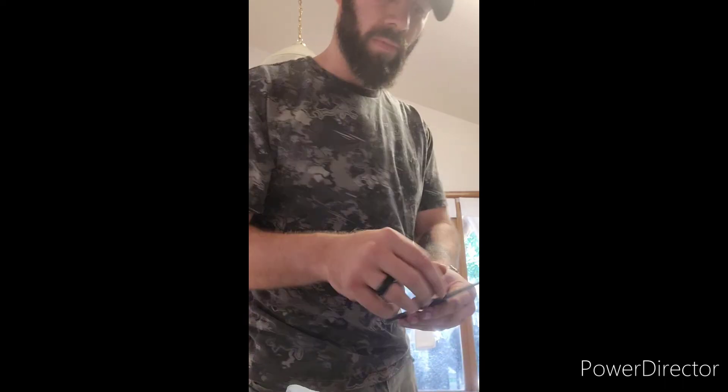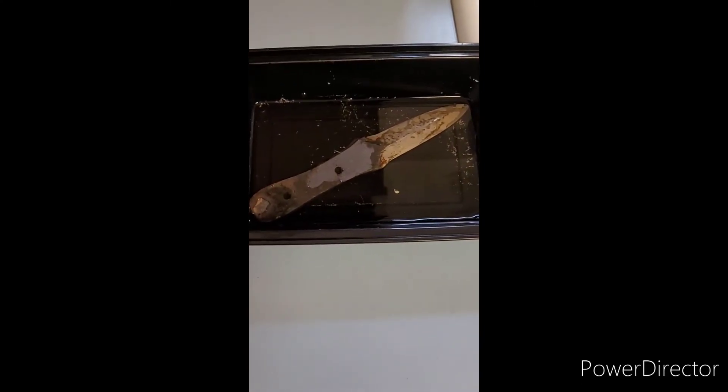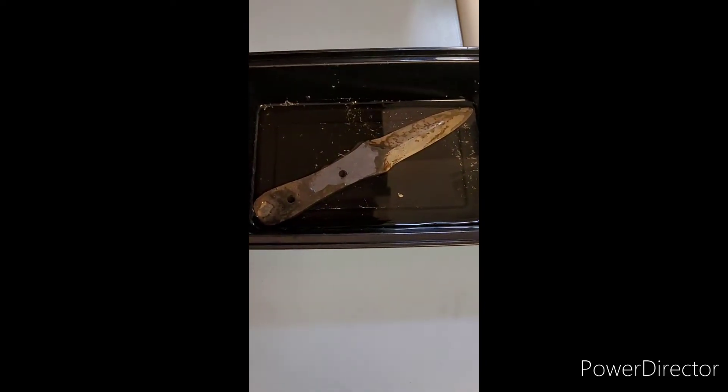Here's the easiest method. I used to do etching by heating up vinegar to put a patina on my blade. With vinegar it acts the same way — it'll eat that rust and create a patina. You're going to have to get used to patina knives with high carbon steel. The easiest thing to do is just dump the blade into a vat of apple cider vinegar. Leave it for eight to twelve hours, and there will be a difference. We'll wipe it off and I'll show you guys the before and after.